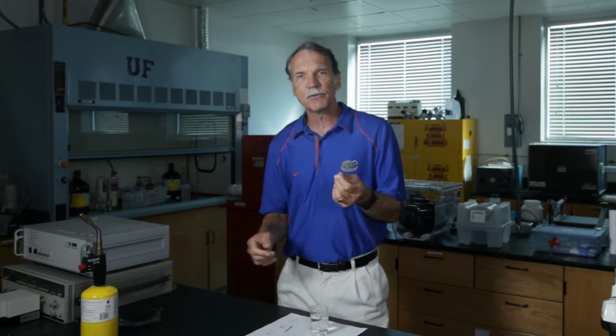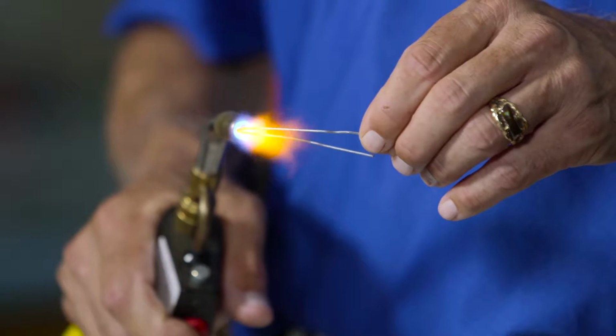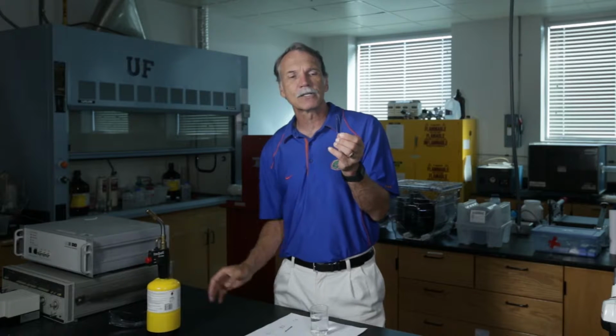Now what's interesting is if you heat this material up and you quench it, so I'm going to heat it up very hot, I'm going to turn it into austenite, all right? And then I quench it, all right? When I do that, I actually quench it so fast that the carbon doesn't have a chance to move around. Now there's only a little tiny bit of carbon in here, so it's not critical.